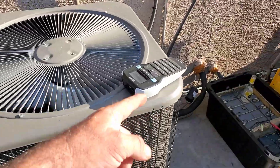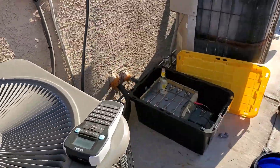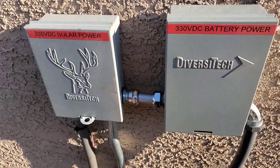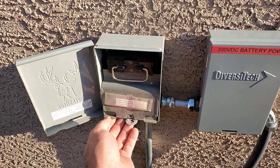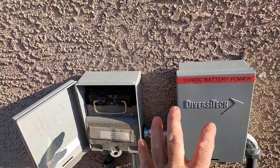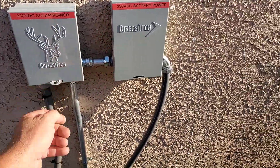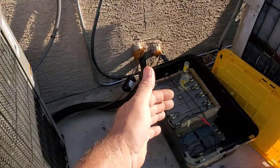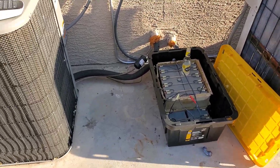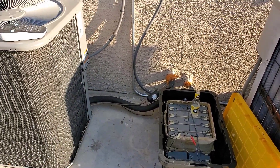I just got myself the label maker, used the red labels: utility power, I've got to put one there for the step-down transformer, solar power, battery power. So remember, I have the diodes in there — the outputs for both solar and batteries go through the diodes, then to the VFD. The reason I have it that way is so this utility power won't charge my batteries. I don't want them charging batteries, especially during peak time of use — that would negate the energy savings. So the batteries only get charged when the solar can charge them.